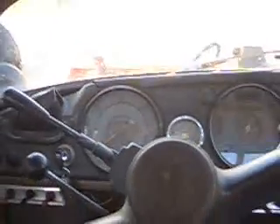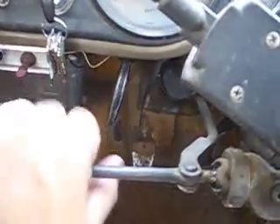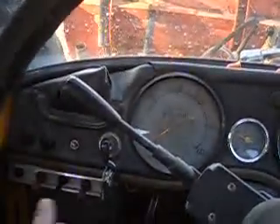Just for fun now, let's show you how you run the hydraulics. You look over on the left side — you look down here, you've got this lever. And that right there is in float. Bring this over, push it down. What do you do? Start raising the blade. Now if you want to lower it, all you do is put it in the float. Down it goes.